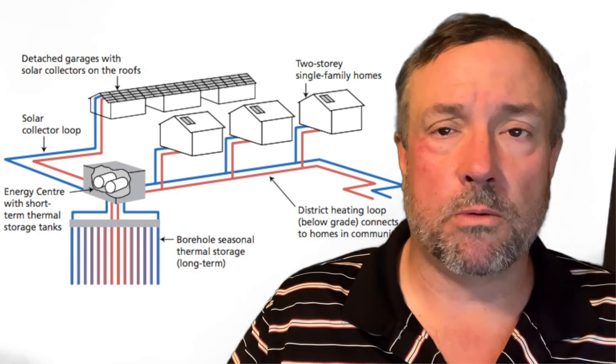Getting heat into the house is pretty simple — we just use radiators. I have baseboard radiators that use convection heat, and sometimes I put a fan on them. In my greenhouse I have a modified car radiator with a fan behind it that puts out an enormous amount of heat. Currently it's running from my wood boiler at about 70 degrees Celsius, and I'd be cautious about running anything much over 80 degrees through the piping given the distances and costs involved.